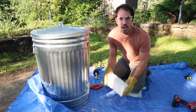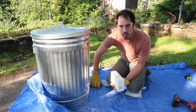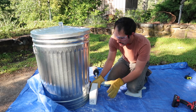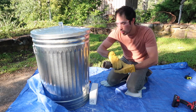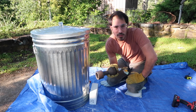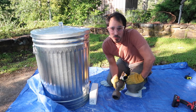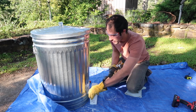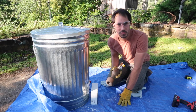All right, so now I'm going to saw a groove into the soft brick here. That's important because the burner is going to stand outside of here when the kiln is firing. The groove is going to hold on to the burner, because if something were to happen to the burner and it might fly to the side or something mid-fire, that would be a disaster. So I thought it'd be a really good idea to make a groove in here and hold it steady. So let's get sawing.